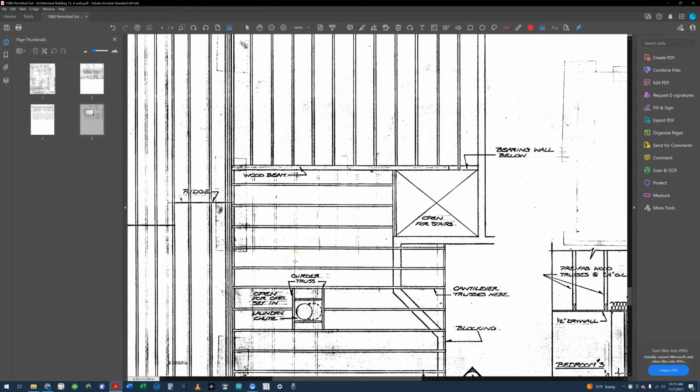So if you see some really significant sag in that wall, I would open up the entire ceiling and see if this is a beam running all the way left to right, clear spanning, or if some knucklehead in the field maybe thought it'd be a good idea. Maybe they were running out of material and they didn't have the full length beams.